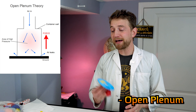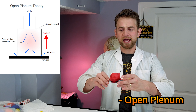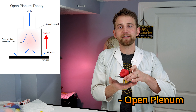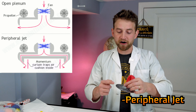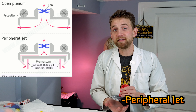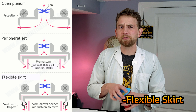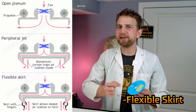Let's get into actual hovercrafts now. There are three main kinds of hovercrafts. The first is open plenum — which is what this type is — where there's a main air source right in the center that pushes down a cushion of air underneath the platform, and that's what the hovercraft floats on. The second is the peripheral jet, where they put a jet of air around the outside that traps a cushion of air on the inside. And the third is the flexible skirt, where they're inflating a skirt around the outside into the center and back out again. It's very complicated, but it's very cool.